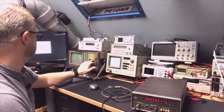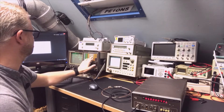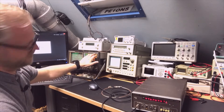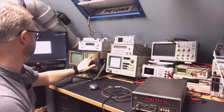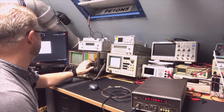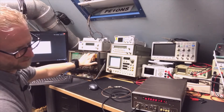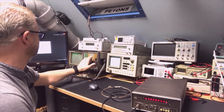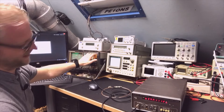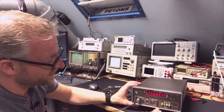Let's try 600 MHz — that works. 700 MHz doesn't work, so let's try 650 MHz and see where it breaks. 625 MHz okay, 630 MHz... 635 MHz is the maximum with an accurate reading. That is nice — it's a bonus because the spec says it only goes to 560 MHz.